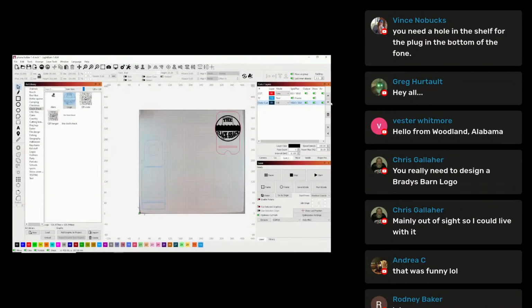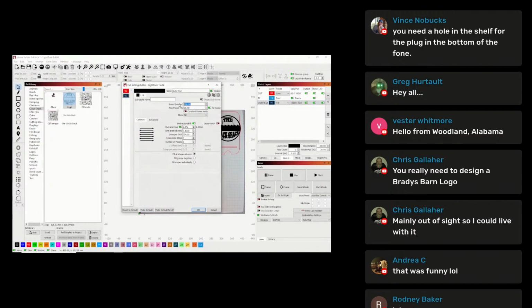Back to LightBurn. So back in settings, I'm going to go 125. My power, 95. Since this thing's got a really strong fan on top of the module, I think it'll keep it away from my air assist. So I'm going to go ahead and turn the air off to cut down on some of the charring. 254 is going to be a little much for what we're trying to accomplish. I'm going to go back to 127 with that on the LPI. I do want it filling all shapes at once. Bidirectional fill is on. Overscanning is on. 2.5%. We're close to the edge of the workspace up here, so if I go too high with overscanning, it's going to error out or cause some issues with that. So we're just going to leave that alone, and we're good.